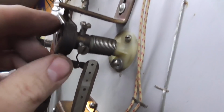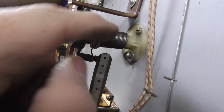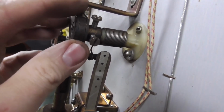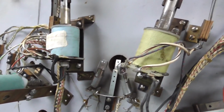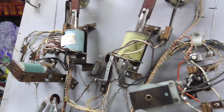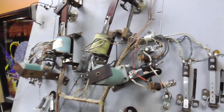You also want to check to see if there is a little bit of play up and down through the playfield. If it's too tight, it'll drag on the bushing. But if it's loose, like this one is, just a little loose, that's what you want. A lot of ones are like that too. And if you notice, the flippers have different color coil sleeves on them. One of those coil wrappers has been replaced at some point. Everything looks good to me on them.